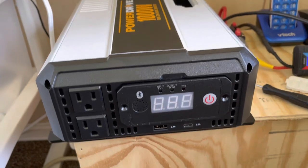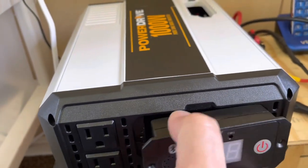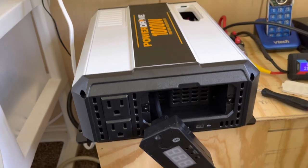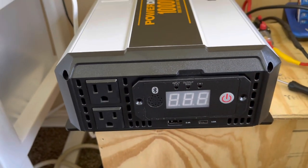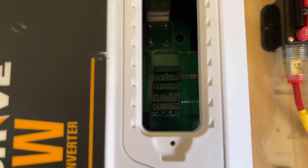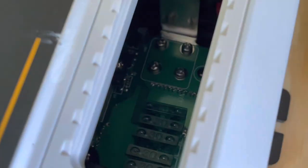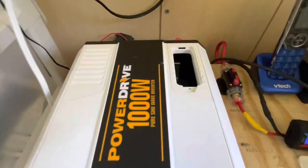Here's the unit itself. It comes with two screw-down locking pins for the face, but we took them out to show that the face is removable. It also comes with an extended phone jack connection — looks to be about five or six feet, so you can run it up into the cab of your truck. Right underneath this little access door are five replaceable 30-amp fuses — you don't find that on many inverters, which usually have internal fuses that can't be replaced. Looking at the circuit board, everything looks nice and clean. Solid battery post mounts are bolted into the control board, not soldered, so this thing should do pretty well.